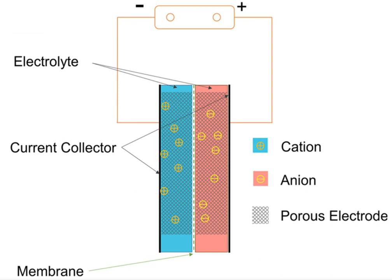Metal oxides. Brian Evans Conway's research described electrodes of transition metal oxides that exhibited high amounts of pseudocapacitance. Oxides of transition metals including ruthenium RuO2, iridium IrO2, iron, manganese MnO2, or sulfides such as titanium sulfide TiS2, alone or in combination, generate strong Faradaic electron transferring reactions combined with low resistance.